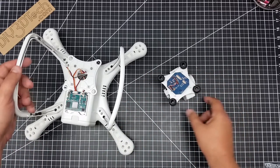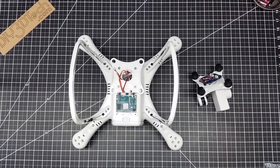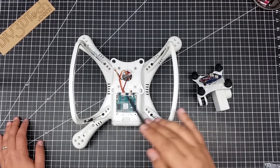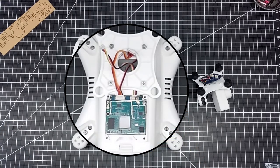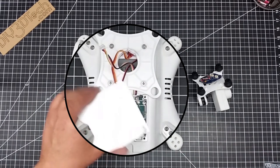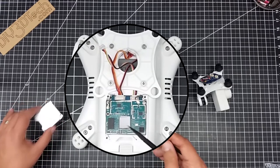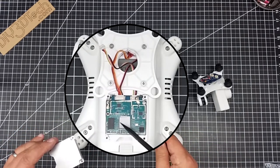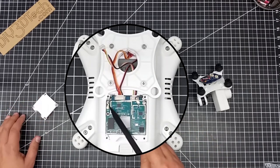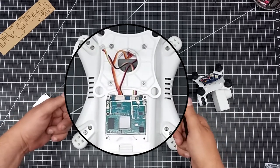Let's hop over to this other unit. One of the things I spoke about in the unboxing video was this really large controller unit. It's got this large alloy heat sink, and that's actually what this is — there's a thermal piece of conductive adhesive which is sticky and sticks to the bottom side of this. You have to really make sure if you take this apart that this re-adheres, otherwise you'll burn up your video transmitter. It also has two SMA clips for antennas on each side, which feed back through underneath into the copter and out through the legs.